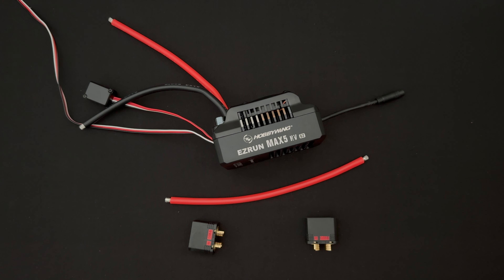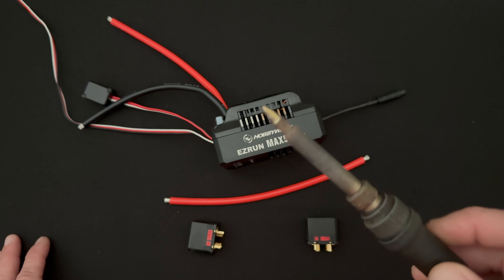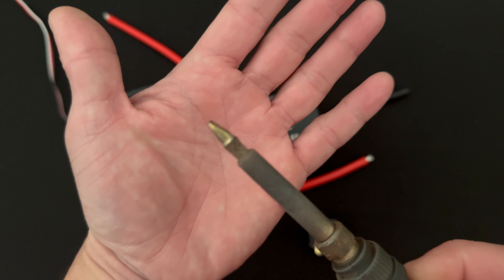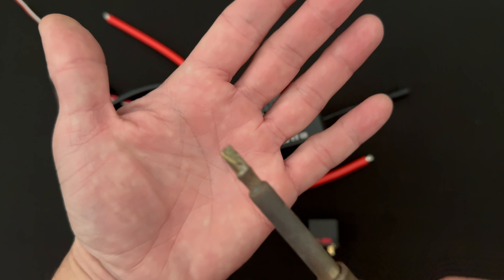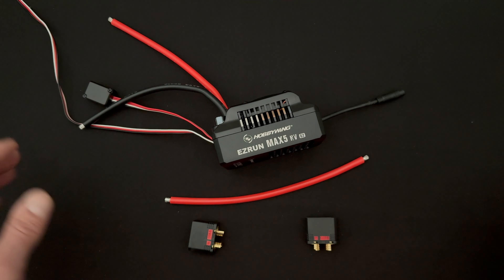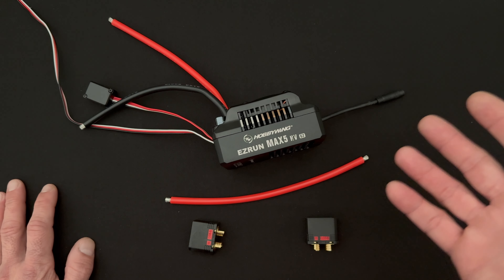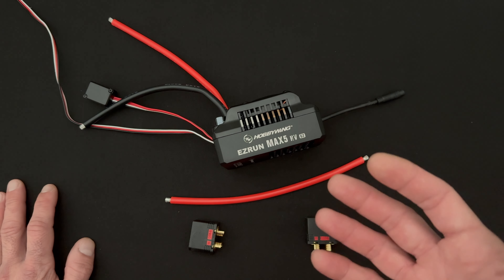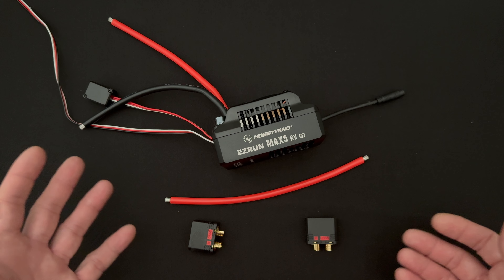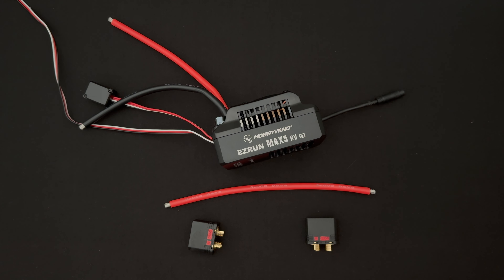One of the big things we talk about is the iron itself. Fancy soldering irons are nice to have. This is a very old Hakko handle with a chisel tip - I'd say a four or five millimeter tip - that I use for most of my soldering. The soldering station base is an old Hakko 928, but there are lots of other options including the little TS100. The temperature range in Fahrenheit is 750 to around 950 degrees, which is a 40 to 60 watt basic iron.